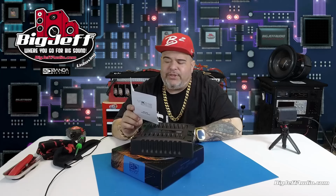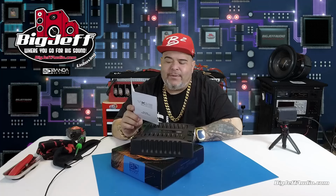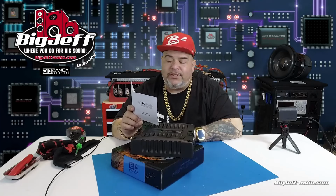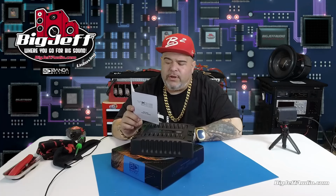High pass filter, 16 hertz to 100 hertz. That's kind of weird for high pass. I'm gonna say that's gotta be kilohertz. But low pass is 80 hertz to 500. So let's say as a misprint here, I'm gonna think the high pass is 16 kilohertz to 100 kilohertz.